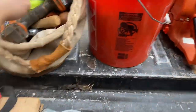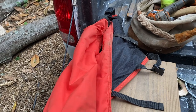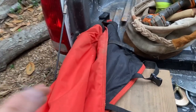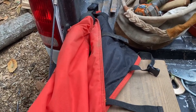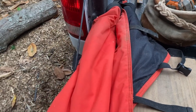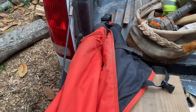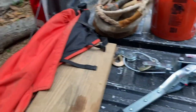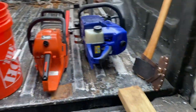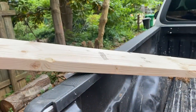I've got gloves, screwdriver, files, all that good stuff. Chainsaw milling is, I think, one of the safest things you can do with a chainsaw. The typical things you need to worry about — trees are already on the ground, the log can roll — but the chaps are really important because when you mill, you're going to throw chips and powder like you can't believe, and if you've been kneeling in that for a few hours, you'll want chaps or coveralls.